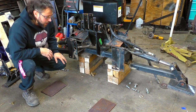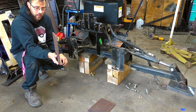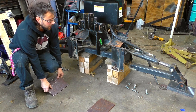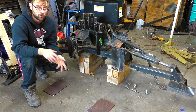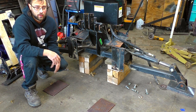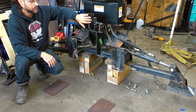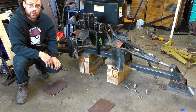The plan is the tractor isn't gonna work, so now we're gonna make a tow-behind backhoe. We got these — I believe that's 5/16" plate — that we're gonna bolt up using five bolt holes. Then we're gonna run tubing down the sides and make a rectangular framework with removable tires to swap to the front, just like a normal one would be. We're gonna run a lawnmower engine, probably like a 15-horsepower vertical shaft — pretty much overkill — but it'll be electric start and easy. I've got plenty of engines. Then we'll tie in the top mount for the three-point hitch down into the framework to reinforce it even more.